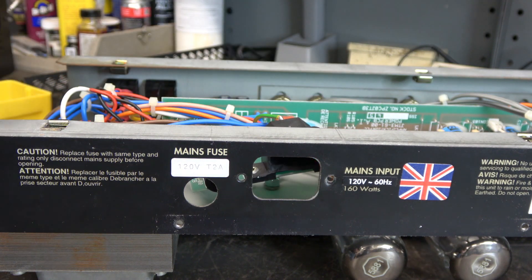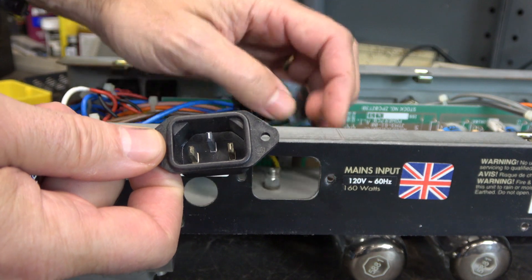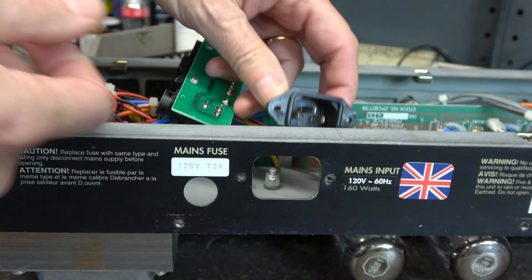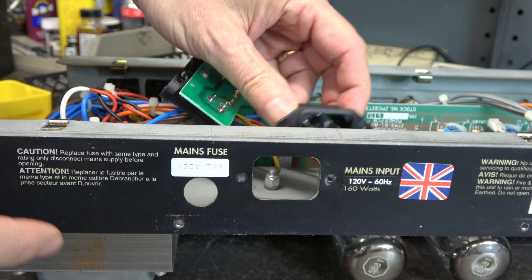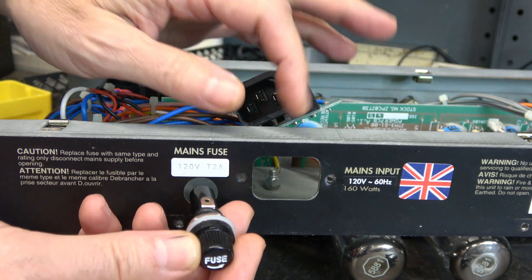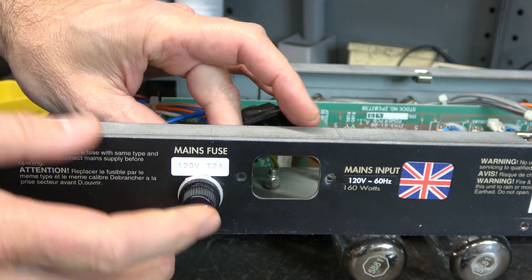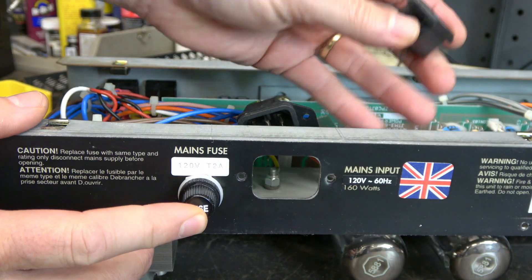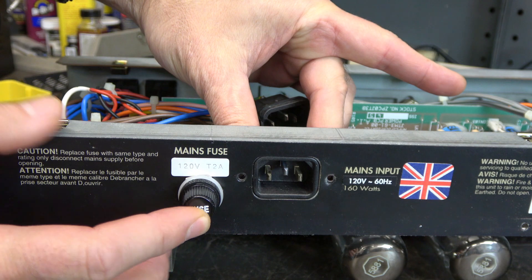What I'm going to do is install an individual AC input jack. I just happen to have one that drops in there like it was stock. Then I'm going to add a chassis mount fuse holder that's going to go in like this. From the outside appearance you'd have no idea that this amp has been altered.